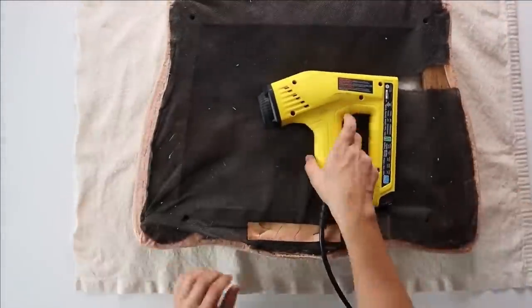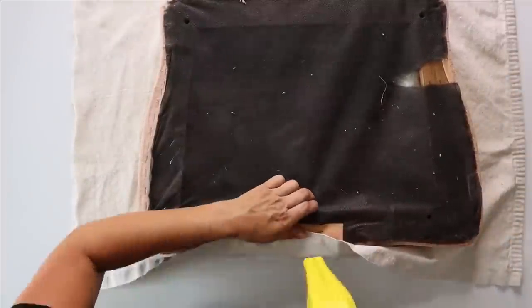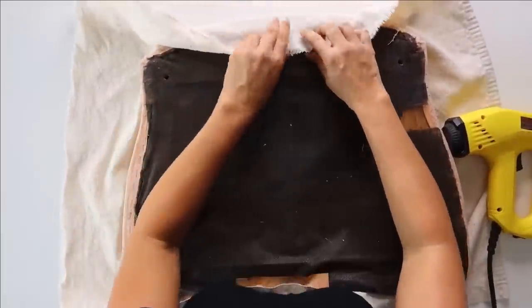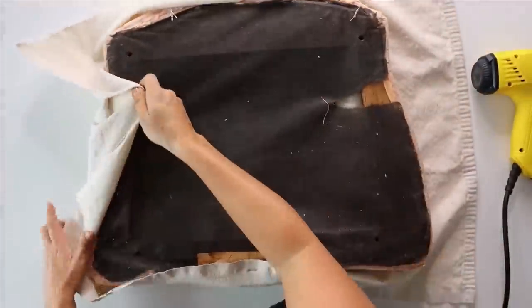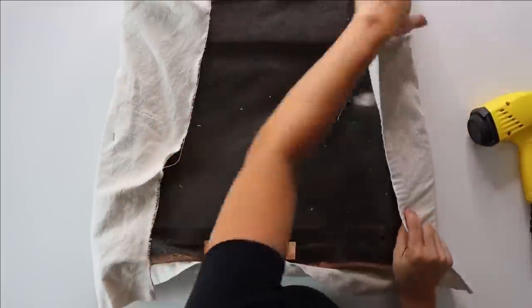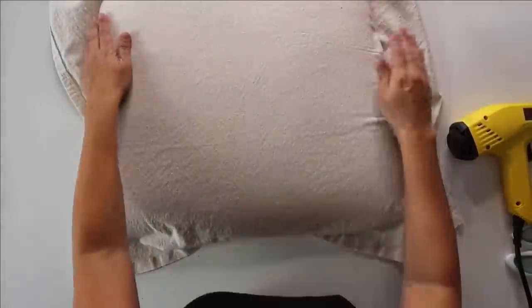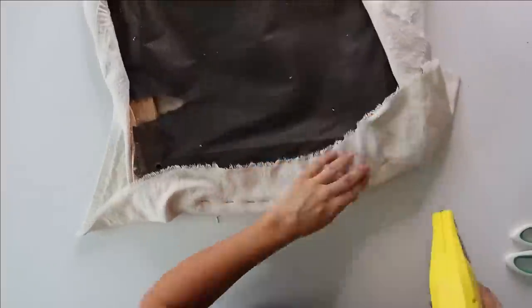Now we are going to cut off a section and wrap the bottom seat in this fabric and just staple it into place. Now you can see how I go about this. You can see that I start from the middle and you work in a north, south, east, west pattern, making sure that it's pulled out nice and smooth, but not too tight, but tight enough. You don't want to pull too hard. And then once you have a staple on each center area, then you work from the center out to the edges.